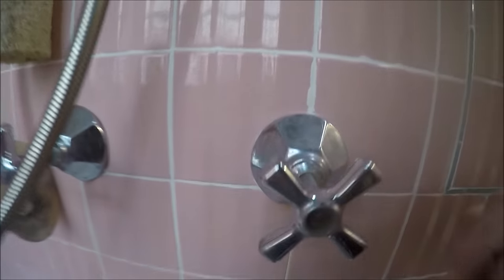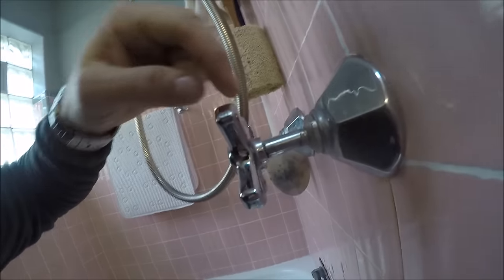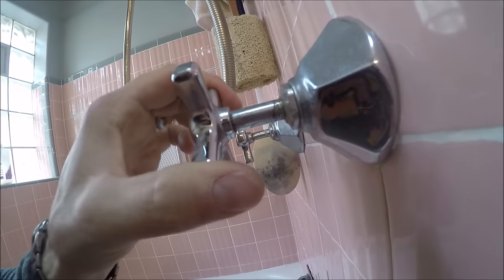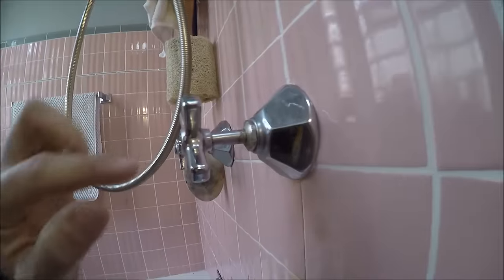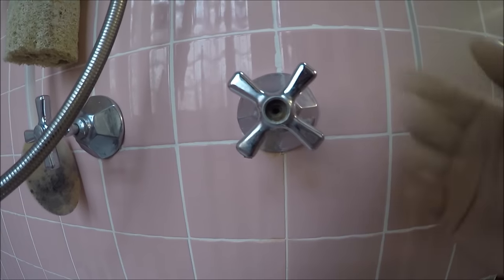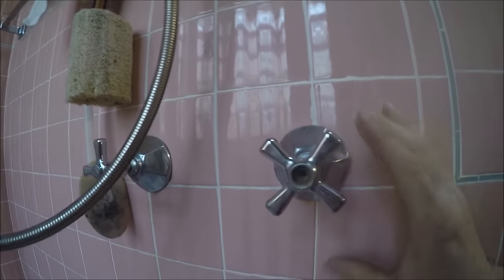I've already kind of run into my first issue. As you can see right in here, it's quite corroded. This knob just seats into some splines that are on this shaft here, but it's so corroded it's not going to pull off. So I'm going to attempt to disassemble this with this still attached and then possibly try to pull this off when it's on a workbench — not banging against it, because this is just a brass fitting in here and things can get stripped out.